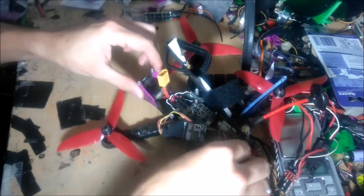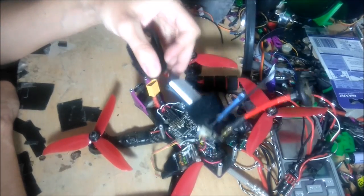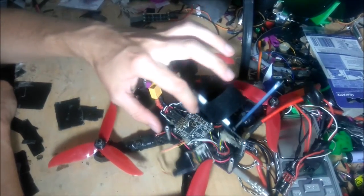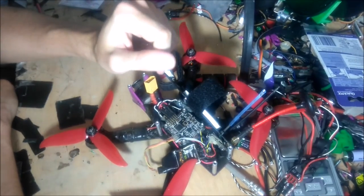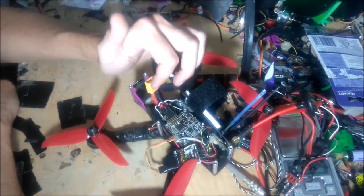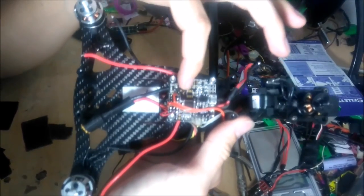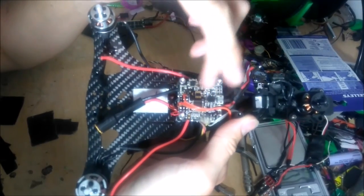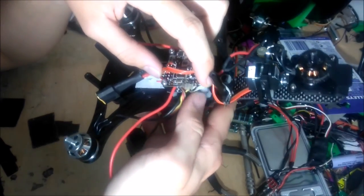I've cut down this servo horn, drilled a couple of little holes, and put a couple little bolts in there. I believe this is going to work. What I'm going to do is take out the old Naze32 Rev-5 out of probably my favourite quad, the ZMR Slim, and put that in the Tricopter. The reason being I found on Banggood a CC3D — like a Revo or something — it's like an F4 flight controller, 30 Australian dollars, and it does D-shot, so it's very good value for money. I've put on the Naze32 Rev-5, did flash it with Tri-Flight, but then I actually re-flashed it with Clean Flight and I'm going to give Clean Flight a go. Tri-Flight's pretty old — it's based on a pretty old version of Clean Flight.